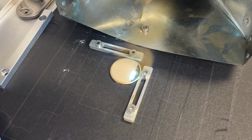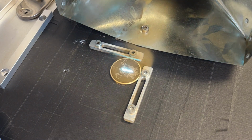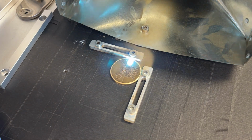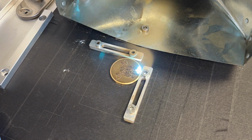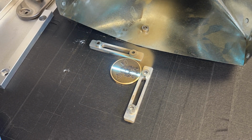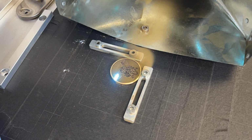Here we are over at the fiber laser, and I did speed this up for time's sake, but you can see here we have 10 passes for the grayscale engraving per one pass that we're doing a cleanup. The cleanup pass will help keep some lines and ridges and abnormalities from showing up in your engrave. Sometimes that happens, but this was my first time doing a 3D grayscale engrave on this 50 watts, so I think I did pretty good, but honestly, when it comes down to it, I'll let you be the judge. We'll have the results here shortly.